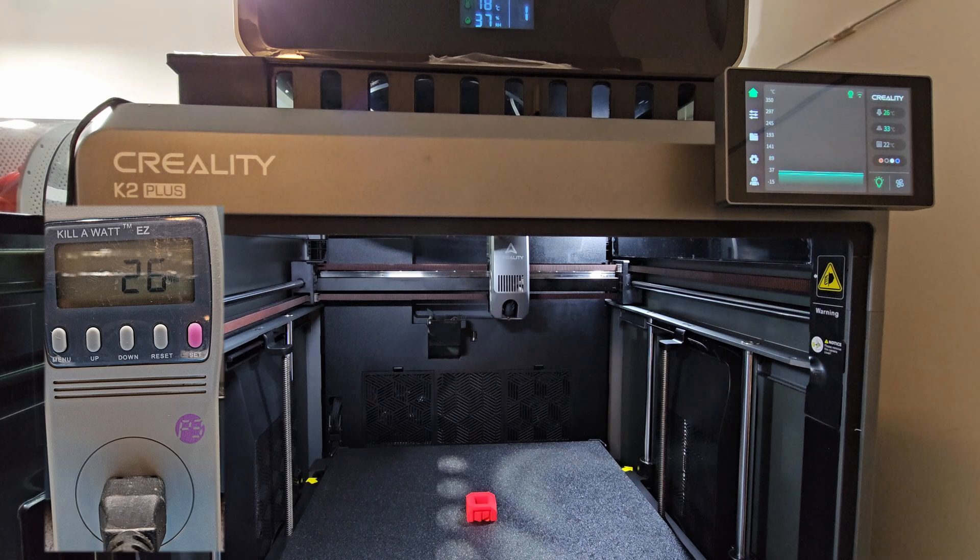If you have a good power grid and don't need a UPS, you don't have to worry about this. But if you're running two or more of these printers together, you might want to consider your outlet capacity. Each printer is taking 7.5 amps, so two of them is already 15 amps - almost at the limit of what your outlet can take. You might start flipping your breaker, or worse, overheat the outlet if it's not properly wired.